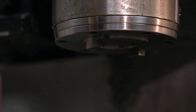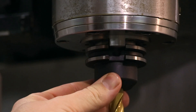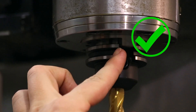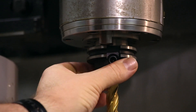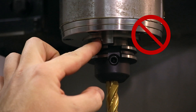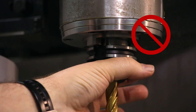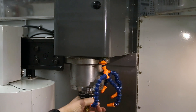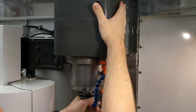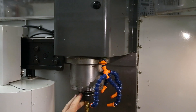To install a new tool, hold it below the flange and insert it into the spindle. Be sure the drive lugs are aligned with the notches in the flange — give the tool a spin to check alignment. Here's what it would look like if done wrong: the drive lugs are not aligned with the notches in the flange. This is a big problem and can damage the machine by bending the tool carousel and possibly ruining the spindle, resulting in thousands of dollars in repairs. If this misalignment happens, simply remove the tool holder and try again. Hold the button as long as necessary for the tool to align, then give it a spin to ensure the drive lugs are properly engaged.